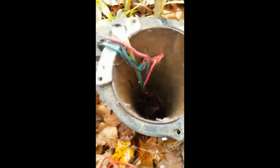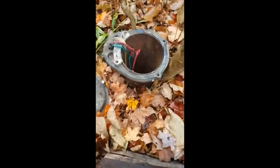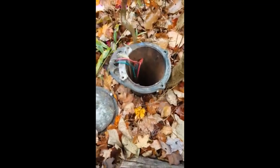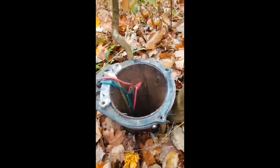So if you look about 3 feet down, it's really hard to see. There's a little brass thing. It's going to be on this side. That's called a pitless adapter, and it has a threaded spot on the top. And you stick a pipe down there with some threads on the end of it, screw onto that, and then you can hook, and that will grab the top of the well, be able to pull that out. Now this one's 420 feet deep and it's a 600 foot well, so it's a lot of stuff down in there. Let me cover this so no stuff goes in this well.